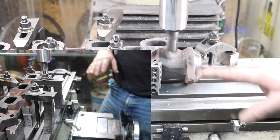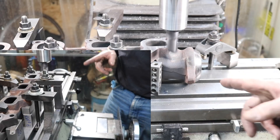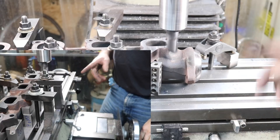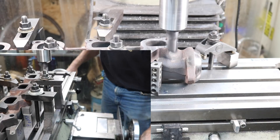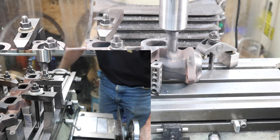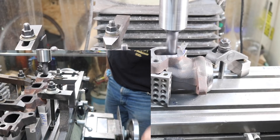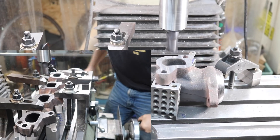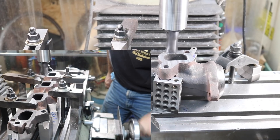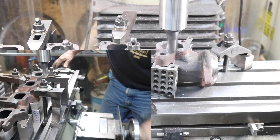The high-speed steel just wasn't working out — it was just wearing the tool and not cutting the metal. So I switched to a one-inch three-flute Niagara solid carbide end mill, and it is cutting like butter. No messing around here. This will be the final pass — it only took two passes and this end is done.